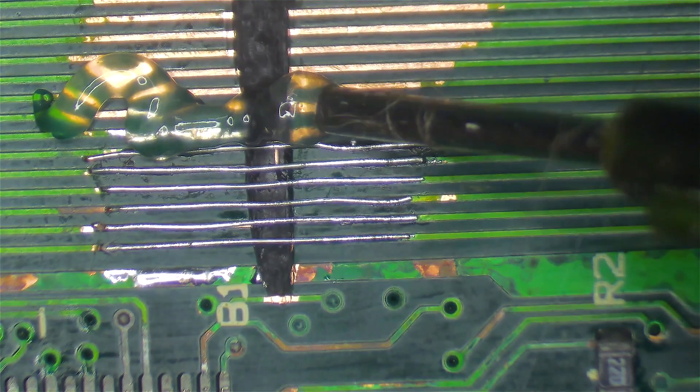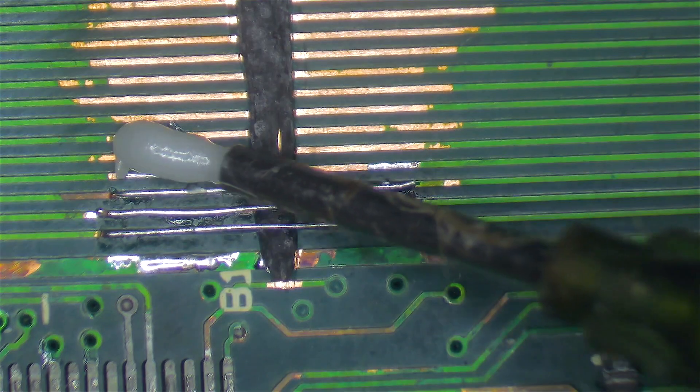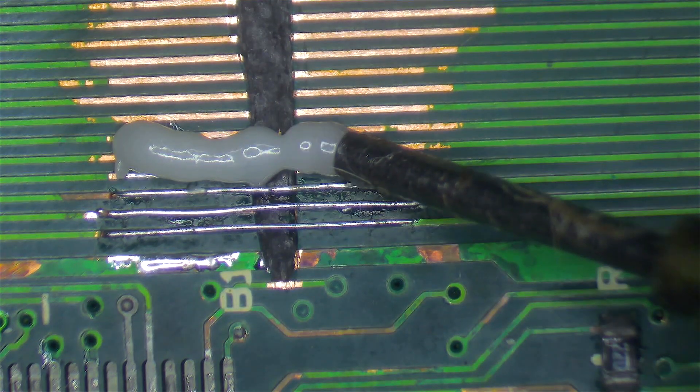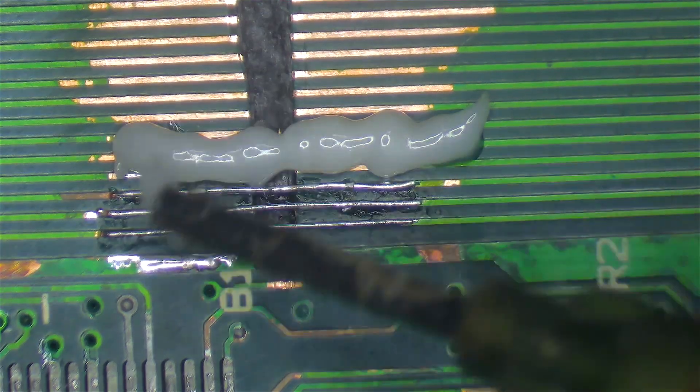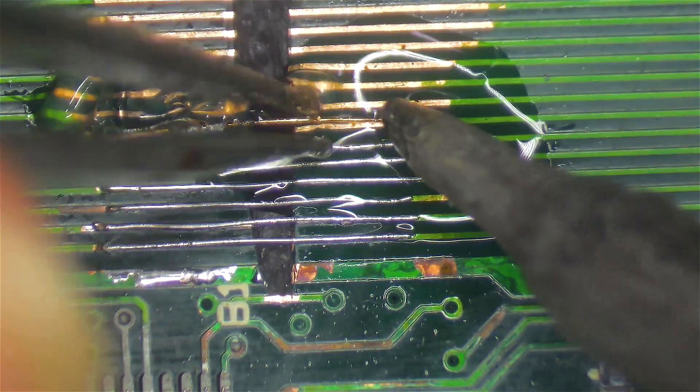For clarity, the winner was the medium temp — the clearest flux I've ever seen, but it had a pretty unpleasant smell and didn't perform as well as some of the others. The Hydra MA, V3, ASM, high temp, and LED also had very good clarity. The MA was probably the worst, being almost completely opaque upon application, though it does clear up once heat is applied. For odour, the best were probably the VSUHF and the BGA, but most were pretty good. The V3 and LED both smell quite sweet, while the MA and medium temp had quite a strong chemical smell.